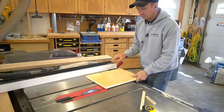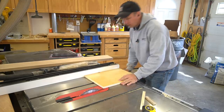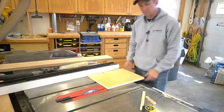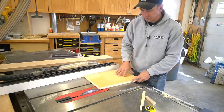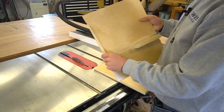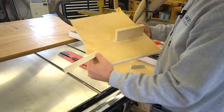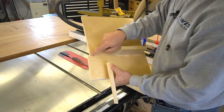I'm going to take my scrap piece of plywood, bring it over and set it. I'm going to note right where I've got it, but then I'm actually not going to move the fence again — I'll show you why in a second. We've essentially created the zero clearance aspect of this, where the front edge of our plywood is going to be the start of our shim. We know we want a half inch on the backside here for the shim, which means we need to run this through the table saw at an angle. To get the angle of the shim that we need, just take a half inch and add it onto this side of the board temporarily and run it through the table saw, and that will give you this cut.